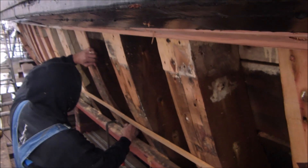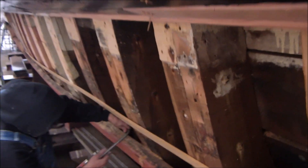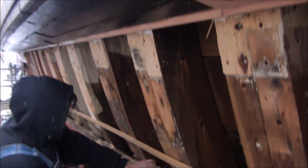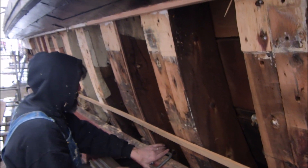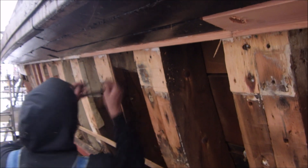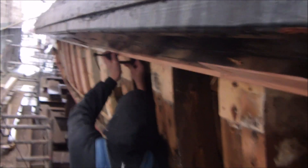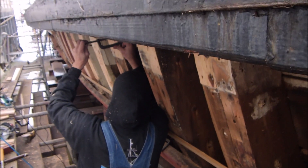The vertical curve of the frame, up and down, can also be tested by attaching a batten along its edge. Getting these curves right just by eye is where the real skill comes in with wooden shipbuilding and why you want experienced shipwrights doing this work.